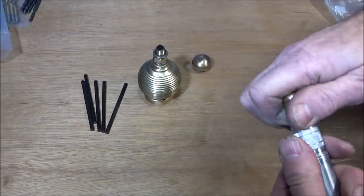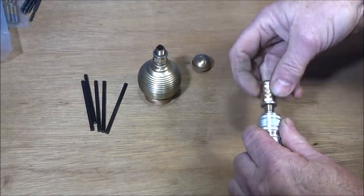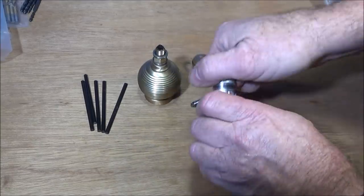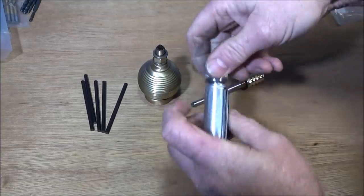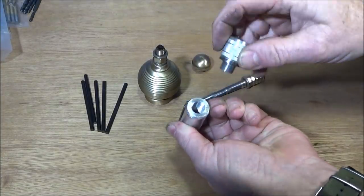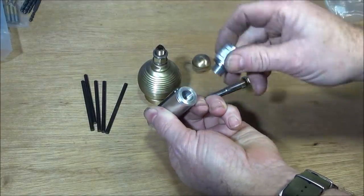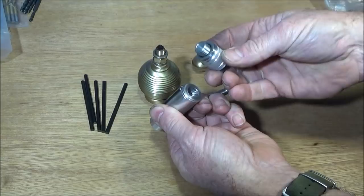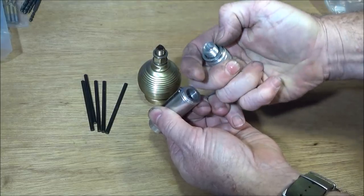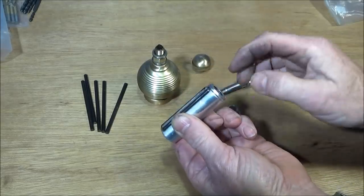And the lighter is actually made out of four different parts really, and a couple of Doughty seals again. The top here unscrews from the actual cylinder as well, and you put some cotton wool down in that cylinder to actually soak up the fuel. And that's a quarter inch Doughty seal on that one. I've shown those before on these little lamps I've made.